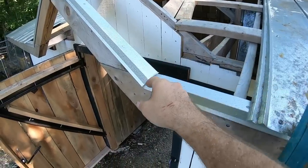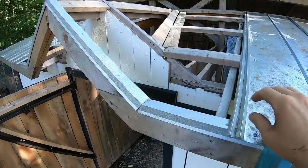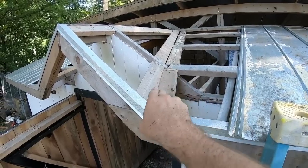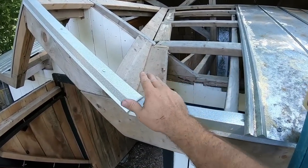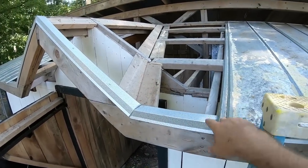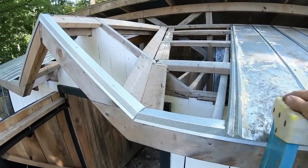It looks like this with nothing in it yet. We just had the fascia board in place. And then we've got it blocked in there. That way it's just got some good solid blocking under that valley. So if anybody gets on this roof and puts a foot there, you may give her a little bendaroo, you're not going to disappear through there.